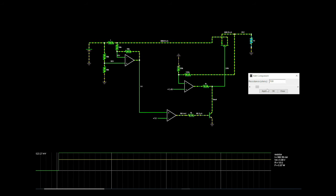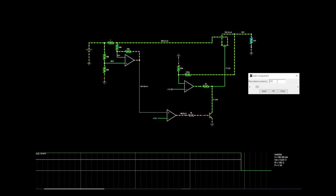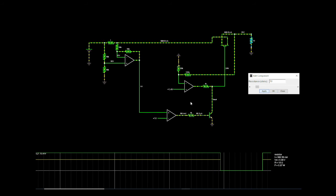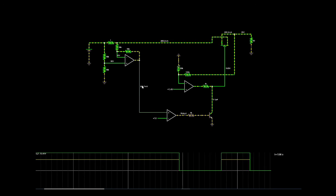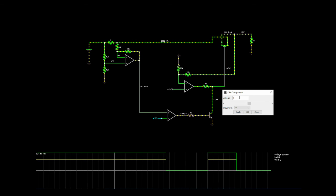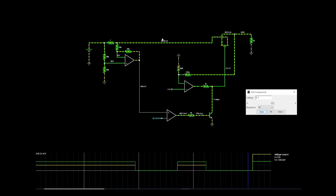And then redo it here. See, now that's off. This thing takes over. We're hitting 10 volts. And we go down to 10 ohms. And it comes back in here. So let's go up to like a 50 ohm load. So we're at 200 millivolts, 200 milliamps. So let's go down to 0.1, apply, same thing. So here we're maintaining 100 milliamps.